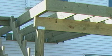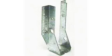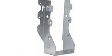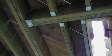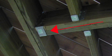We see a lot of situations where they're just missing joist hangers. Maybe they have them on the house side, but on the outside beam, often they're missing. In this picture, the joists are cantilevered over the top of this beam, so joist hangers aren't needed on that end. This is a single joist hanger. This is a double wide joist hanger for situations where the lumber has been doubled to carry extra weight. You can see that part of the weight of the deck is transferred to another member.